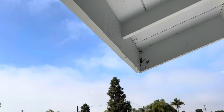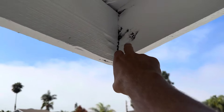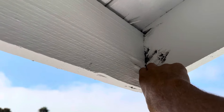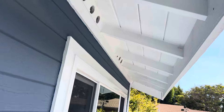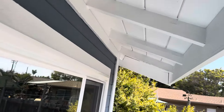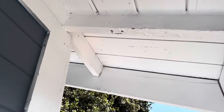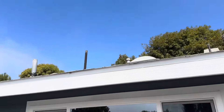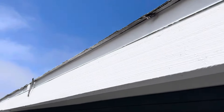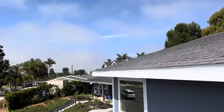It shows us how good of a job the roof is doing as far as keeping water off the property. You can see we do have some wood rot going on over here in this corner. This house was just recently painted, so a lot of bondo was used to seal off some of this bad wood. We can see there has been some termite damage in the past as well. There will be some wood repair on this project, but because they replaced some of the fascia board and painted everything over, I don't see the wood repair getting too extensive on this property.